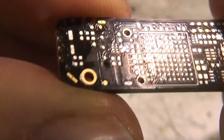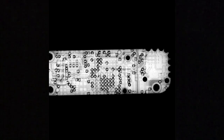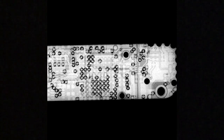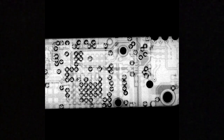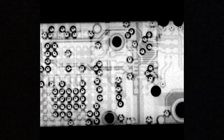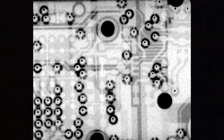We've got a nice sort of flattened PCB — mostly there's a black resist so it's hard to see the tracks. I'll give this a quick x-ray. You can see something in the detail but it isn't actually all that helpful because you can't really tell which tracks are from which layer. You can pretty much figure out that it's four layers and you can see some ground plane breaks and a few tracks here and there, but it would be very difficult to completely reverse engineer purely from this image because you don't really have any layer information. It wouldn't be impossible but it would be quite a lot of effort.